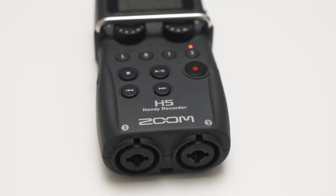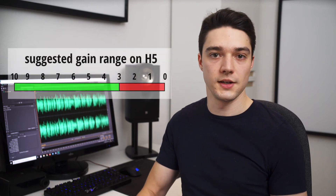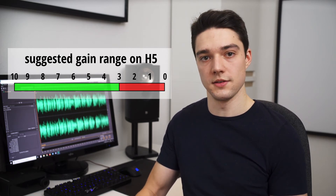After that I made a few more tests to find out the exact point where this clipping problem occurs. Turns out that when you turn the gain lower than 2.8, this clipping problem can show up. That's the case with both the XLR inputs on the H5 and also the TRS inputs. When you use a gain below 2.8, the signal will always clip if it has an amplitude greater than 1V RMS. It appears that below 2.8 the audio is only attenuated digitally, and if the signal is already clipped in the analog-to-digital converter this simply turns down the clipped signal. Because of this I advise you only use the gain range from 10 to 3 — there everything behaves as it should, and the signal only clips when you hit 0 dBFS.